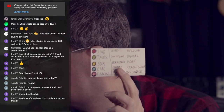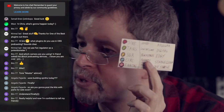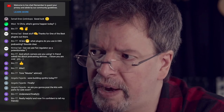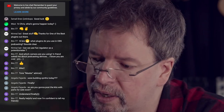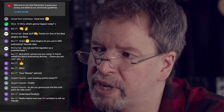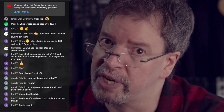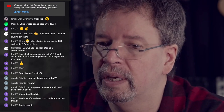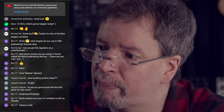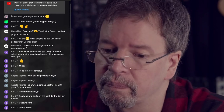And I do have it set so the video capture from the feedback, the ATEM Mini, is going to a Razer Ripsaw, and the Razer Ripsaw is what's going to the computer. And that's part of how the visual quality is, because the ATEM Mini's input to the computer when it works is motion JPEG, but the Razer Ripsaw is just basically a frame buffer at 60 frames per second. It's designed for gaming. It is indeed a capture card, but it beats the crap out of the ATEM Mini's virtual webcam, which also doesn't really work, and the Razer does. So all of that is very good.